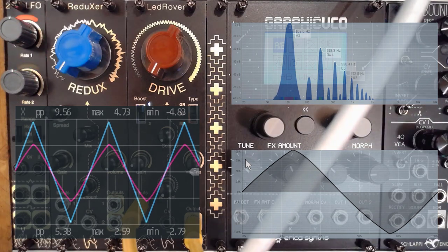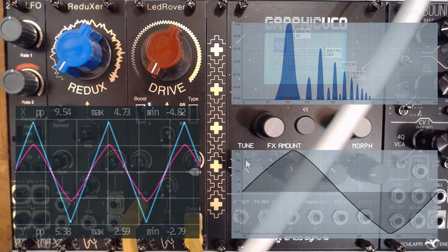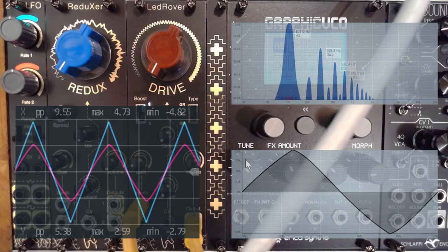There's a bit of tolerance. It's not exactly sharp there, so it'll behave differently. So what you'll then see is that with the red LED, you'll get a very rich compressed overdrive, and with the blue, it's going to be more crunchy. It's going to be more responsive, you might say. And the germanium one is defined by a more old school kind of sound. You might call it vintage or brocante if you want.